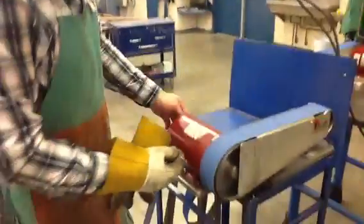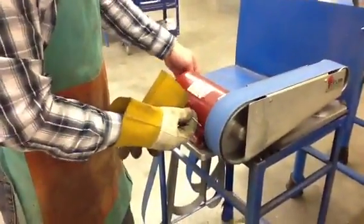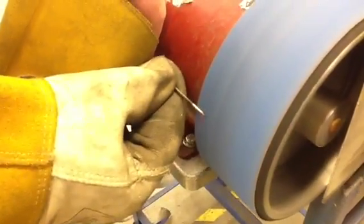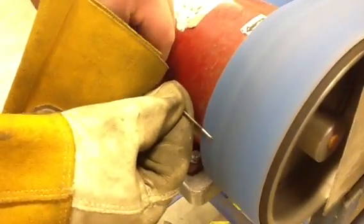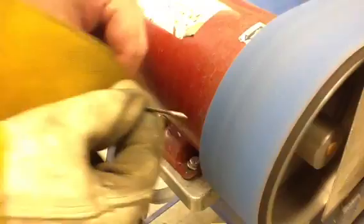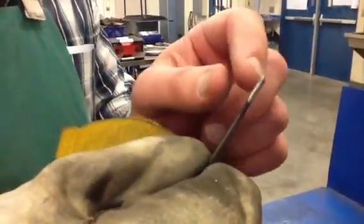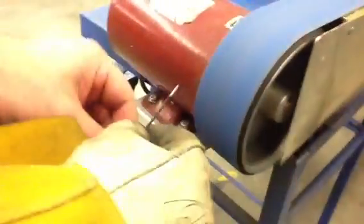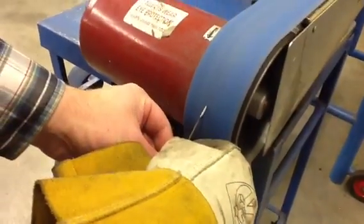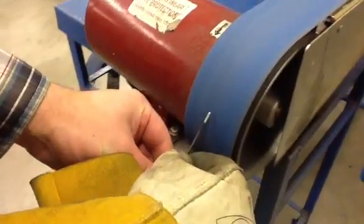Because there's metal on the sides, I'm going to take the contaminated metal off the sides. Notice when the sparks change — they get to a real dull red-orange — that's the tungsten being ground away. I don't want to take off a lot of diameter, I just want to clear it up. Now I'm going to sharpen the tip. You've got to be careful — this is against what we know as the rules — but you face the tip into the sander so that all of your cut marks from sharpening are vertical. That helps the electricity travel down the tip and into your metal.